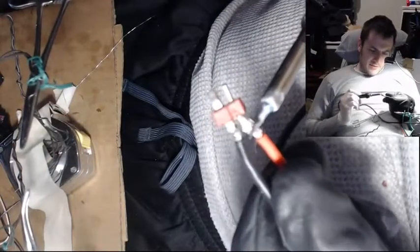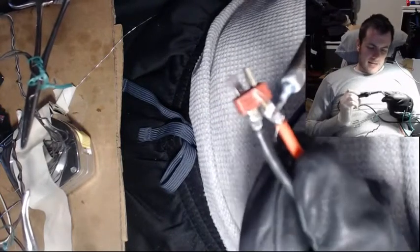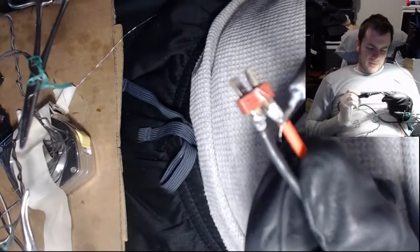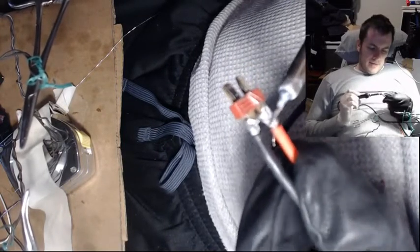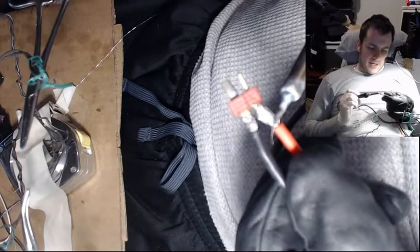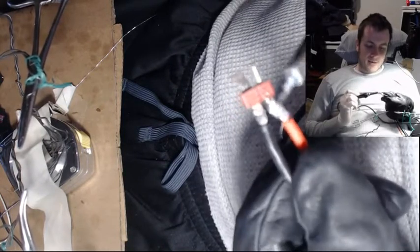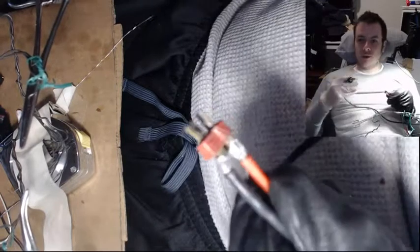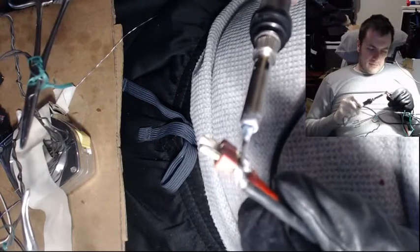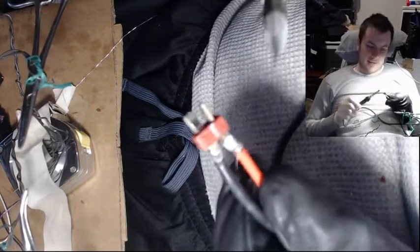Funny, the irony is usually when you get to this point with a lot of solder on here and it's not looking how it's supposed to look, you'd give up and say, oh, it's a cold joint, it's not going to work. But by leaving the soldering iron on there and continue to work it and shape it, it actually becomes no longer a cold joint, because it gets so hot, it's like a reflowing of the solder, and it ends up being actually like a properly hot joint where everything's sticking.